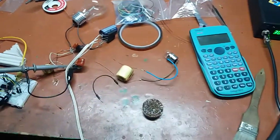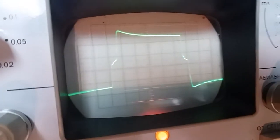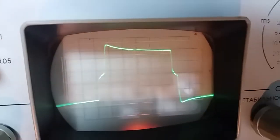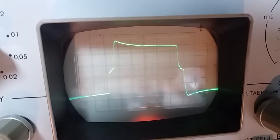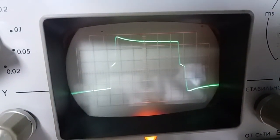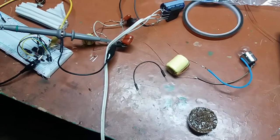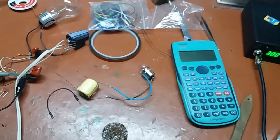We have the gate drive on the scope — let's plug it in and see. We have the light bulb glowing just fine. The gate drive does not change a bit — well, it actually does change very slightly if you pay close attention to those steps I showed earlier, but that's nothing terrific. So that's what I'm dealing with right now: a little half-bridge power supply to be embedded into the enclosure of the soldering station.